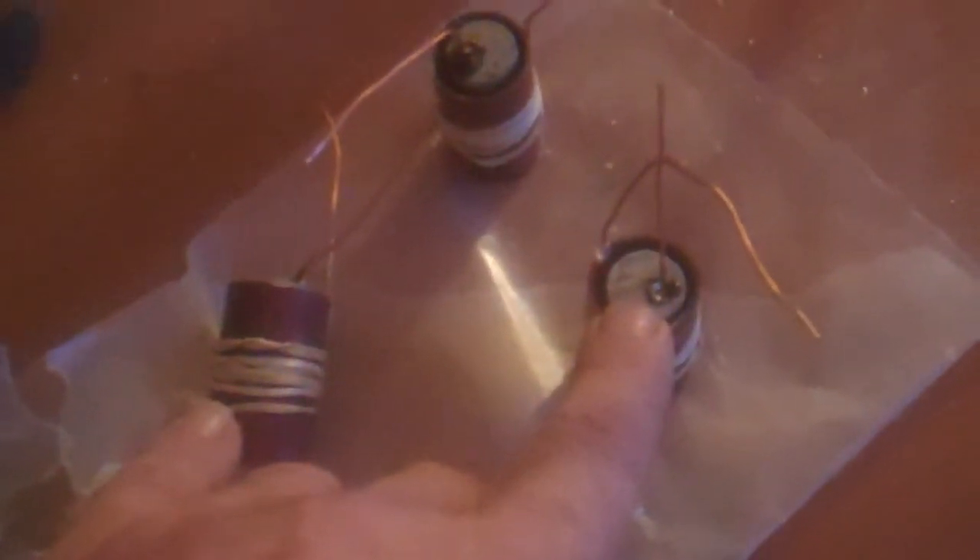I went ahead and filled that little hole with solder and soldered the anode directly in. I did check to make sure I had conductance on everything before putting this together. Then I took a hot glue gun because I was having problems with it being sealed — I sealed the bottom like that. It can be adjusted a little bit, and then I'm going to fill it with the crystals a little later. If I ever had a question on whether the electrodes were touching, all I had to do was connect my voltmeter. I did have to redo a couple of the magnesium sticks — one of them three times actually. It's not really all that easy to do, but it can be done.